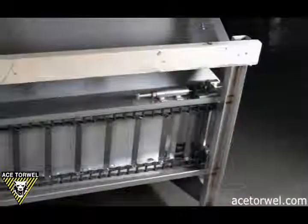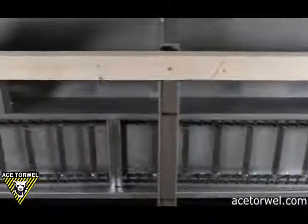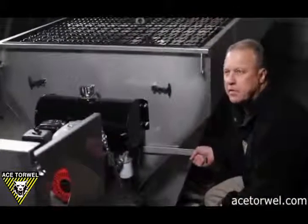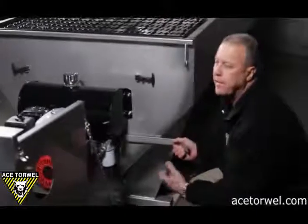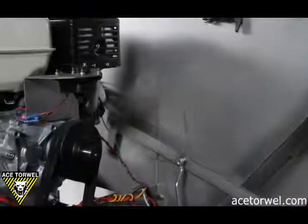Underneath the body, we put a tubing that we run the conveyor chain over so that it keeps it up off the truck bed floor. As part of the hopper assembly, we include an adjustable gate to the rear of the hopper. This allows for just a release of the lever nut and an up and down motion to either close the gate for less material flow out the door to the spinner disc, or open the gate for more.